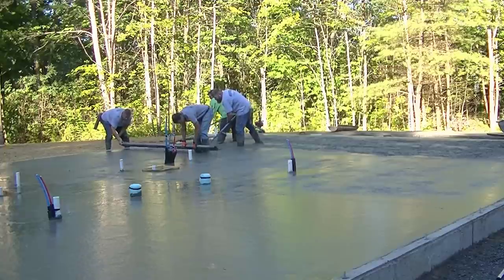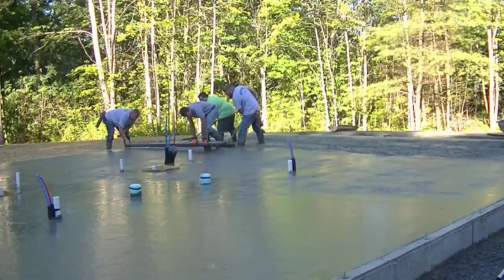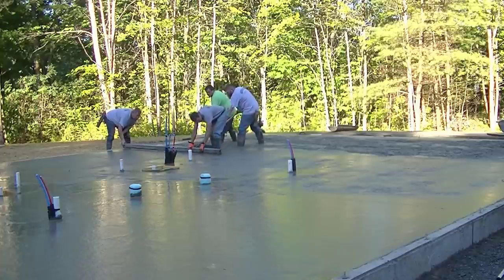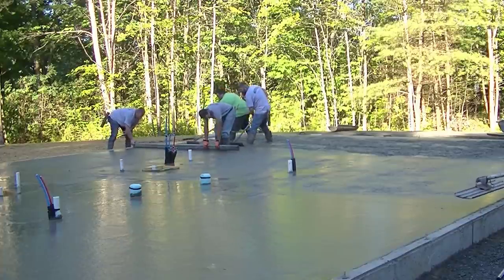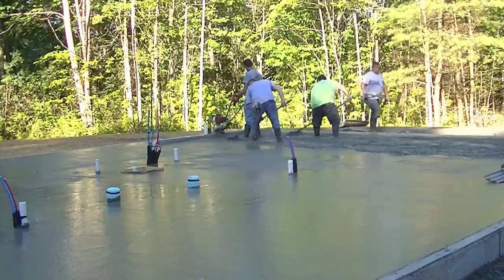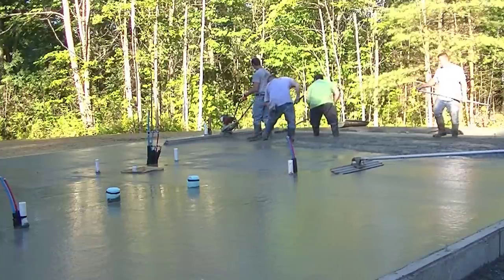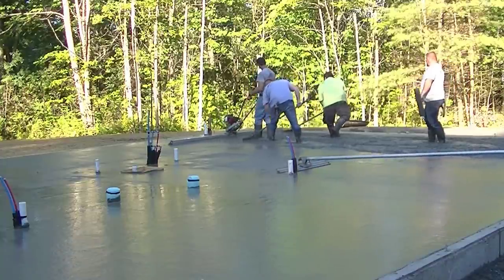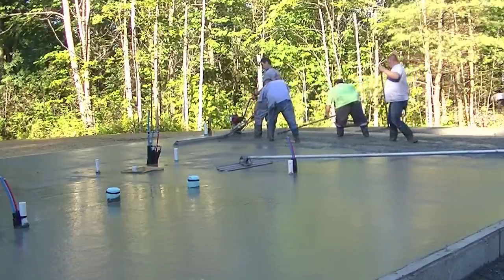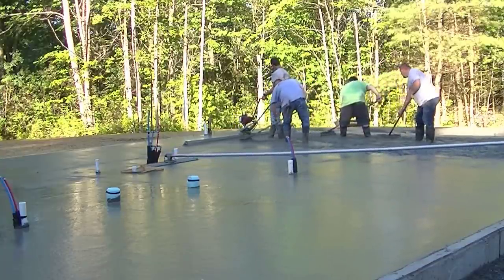You can see we both have to bend over, two guys raking behind us, and the hand screed doesn't push the aggregate down quite as far. Even so, it's still not that hard to bull float — you can see Tia bull floating right there, there isn't a ton of effort, especially with a six-inch slump and a good workable mix.